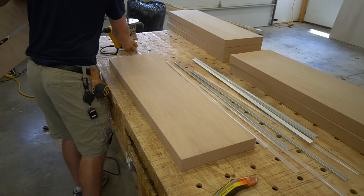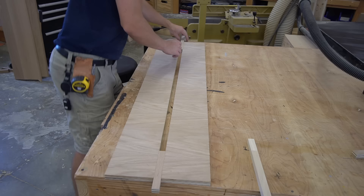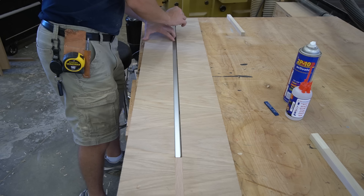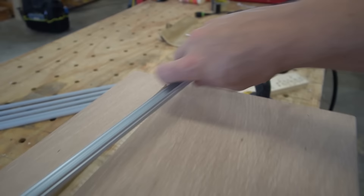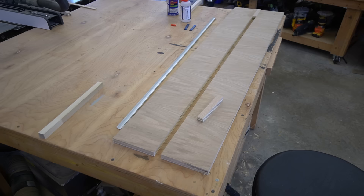There are four basic parts to this jig: two pieces of plywood that we just ripped and two spacer blocks. The spacer blocks are the most important part of this whole process. Since we're using an offset guide bushing, our spacer blocks need to be one-eighth of an inch wider than our actual aluminum channel to account for the offset between the router bit and our guide bushing. If you make this too tight, you might have trouble getting your aluminum channel into your dado or removing it, so ideally you want a little bit of extra space.